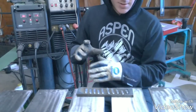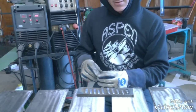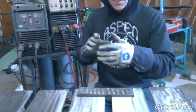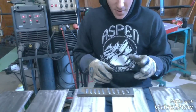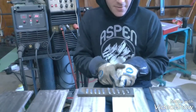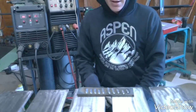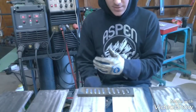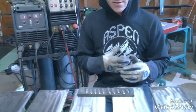But then what you're going to do is get the material type that you're going to be welding on — say an eighth inch. Tack a couple of those pieces together, some T-welds or outside corners, whatever you're going to be welding. Weld it with your 17V, weld one with your 17.5, 18, 18.5 — see which one you like, see if it's got the penetration profile you like. Cut and etch it if you want. That's how you're going to figure out what you need for that material type.